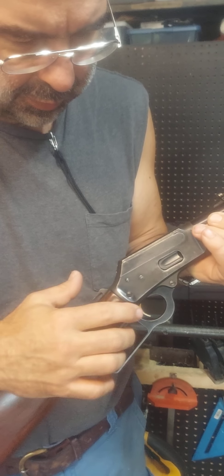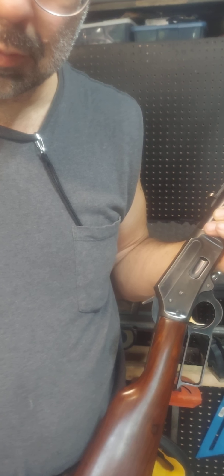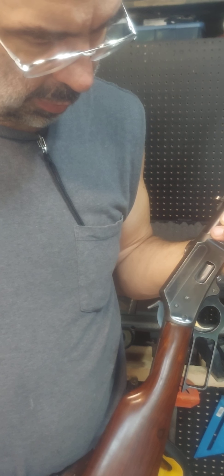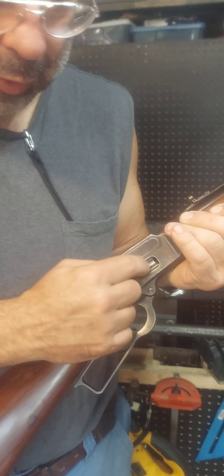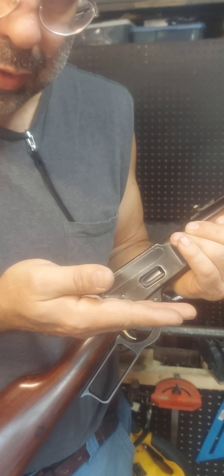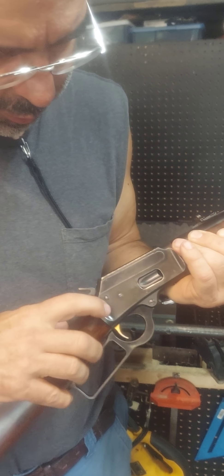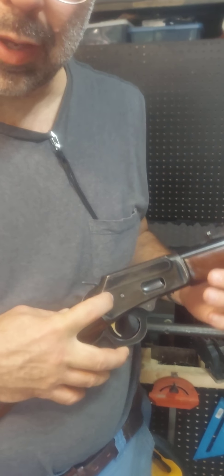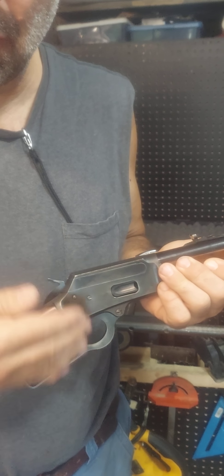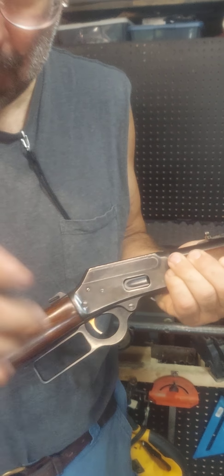I'm still going to take it apart and work on it as preventative maintenance. I'm going to take a round off this lever a little bit and then fill in the divot. I was going to fill in the divot and add a little bit of metal, because this lever is pinned back here - the carriage is pinned on this bolt. Where it rubs, I'm going to add about five thousandths of material when I weld it, just to make it sit a little bit higher.